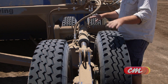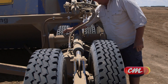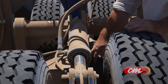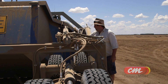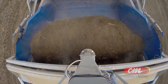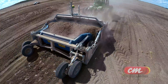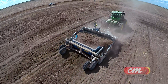This is the auto levelling ram for the whole bucket, so it tilts it from side to side. You can see the strength they've put into this here — this is a solid piece of steel. The machine has got a bit more of an angle in here to get the dirt on the inside so that it can actually force the dirt in and you can get more dirt in the bucket quicker. On the back, it doesn't actually have the strengthening beam across the back anymore, so it's all open — you can push more dirt in and get it in there as high as can possibly be achieved.